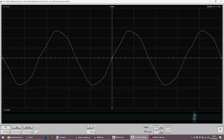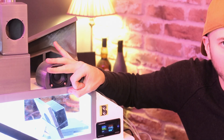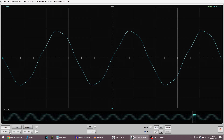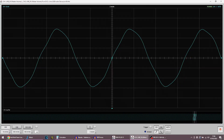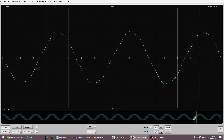If we go back to the scope screen, what's even more interesting is if I put my hand around the port here — my finger wraps around it to extend it a little bit — it actually cleans up the sine wave even further. So I think that the resonating harmonic is going on in that last little bit of the port, the last little tube coming off the smaller chamber. By putting my finger there, I'm extending the length of that, therefore changing the frequency that this harmonic would occur at. But yeah, interesting. So with the science out of the way, let's throw it in the test cabin and run some bassy tracks and see how it actually sounds in there.